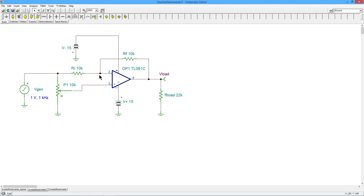That's exactly what we saw. And you can guess — if we go somewhere in the middle, say three-quarters, we're going to get three-quarters of a volt on pin 3, three-quarters of a volt on pin 2, that three-quarters across RI establishes a current and produces a voltage across RF. You can go through this on any number of iterations with different values. We've got the two endpoints and the middle point covered.